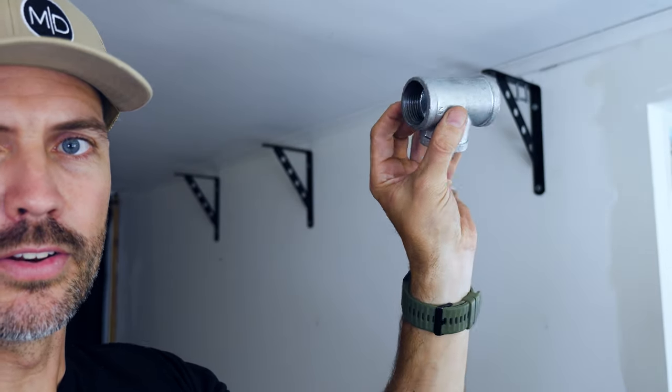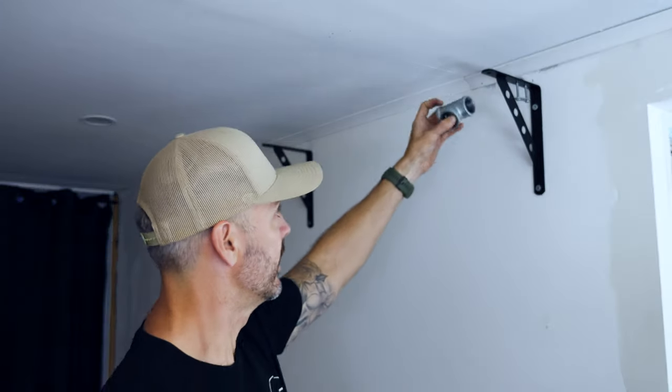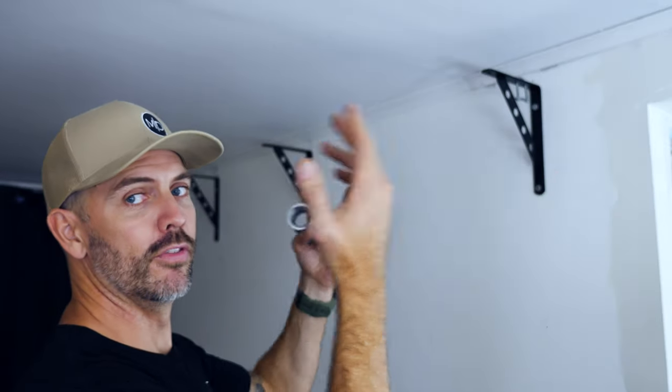The whole idea of this system is that there's a bar running along the wall. On top of that bar sits a T-section and then a reducer. The reducer is sized to the clamp's thread and the T-section is a little larger so the assembly can run and slide along the bar — adjusting spacing for wider or shorter boards. Then the clamps go into there. I'll move on to showing you the shelf at the bottom that creates the angle so that when you put your boards in they don't fall on you, and you can get a clamp-up done pretty easily with a free set of hands because the clamps are held on the top.